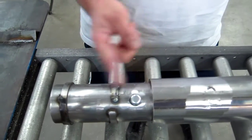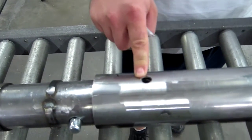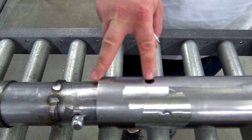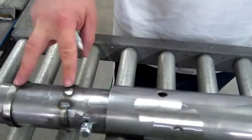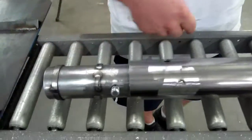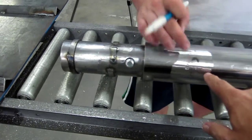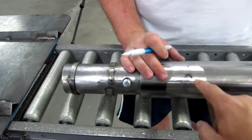The button hole is 1 inch from this plane here, not right here. This is a through-hole for one of the pulleys on the left side — it's 3 and a half inches, or 3 inches from the bottom. Inside here are also 2 more of these. This is a 12 inch insert and it's just symmetrical. We welded it in — there's a half-inch stud in there, a pin going all the way through.